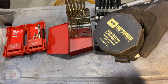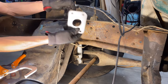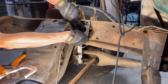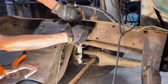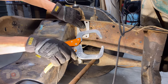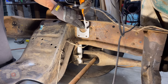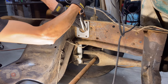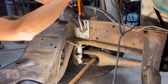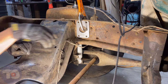It's a really cool kit. Let's go over to the car — I've got a project I'm working on. The placement of my cross member is going to be right here on the frame. I want to put this bracket up high against the top, and just forward of this bolt I've got these vice grips I can use to hold the bracket — it's kind of like my third hand. That'll make sure it doesn't go anywhere and I can use both hands to do what I'm doing.